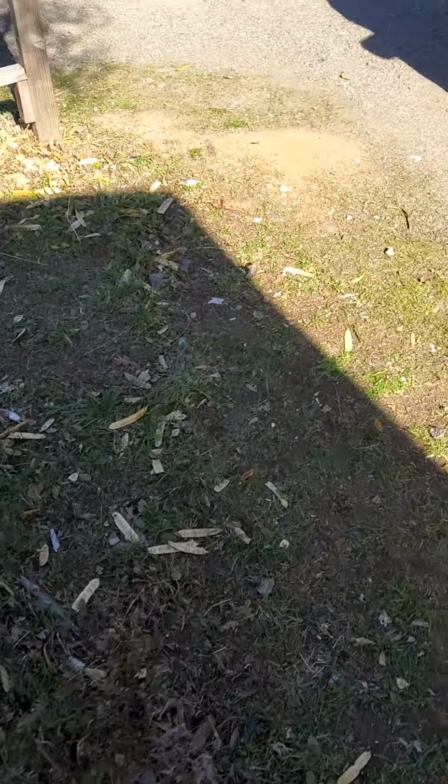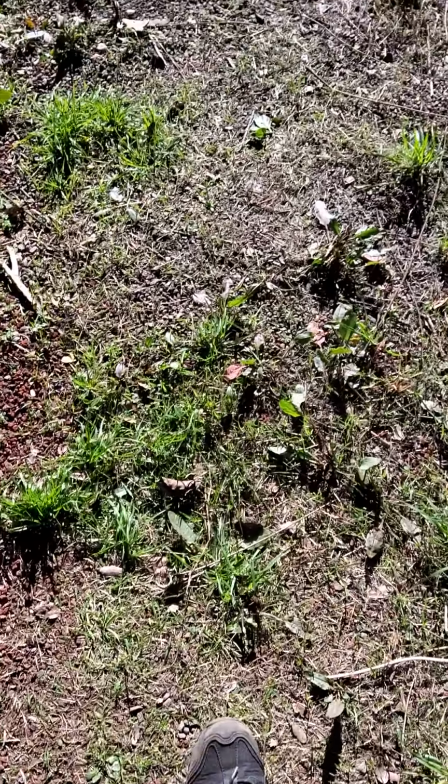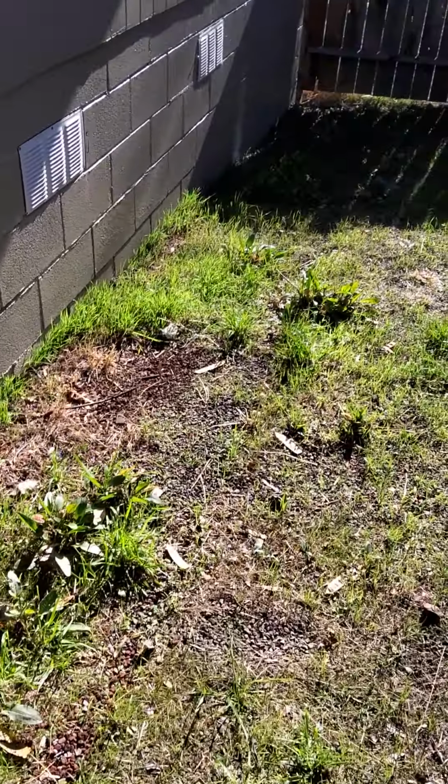I want to show you the concern that the pest inspector raised about wood rot. There is no wood rot or any evidence of any kind of leak whatsoever inside the attic when I went in. This right here is just beginning evidence of possible water intrusion from the existing roof before. This is a metal roof. It's not going to leak, especially when it's a couple years old. This is also not part of the house. This is the overhang. So if there was a leak, and there isn't, it would be going through your ceiling. Basically, because the roof pitch is so narrow, it's probably a 2 in 12 pitch, if there was a leak in there, you'd be seeing it going through the drywall.